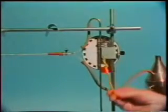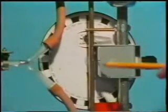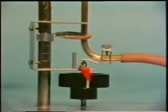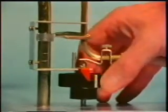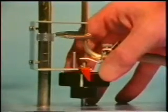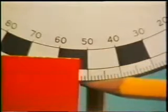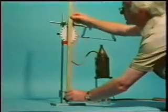Let's look at the back. Just here there's a thin metal shaft — a sort of axle. When the brass tube expands, it will rub against this shaft, causing it to rotate, and the dial attached to the shaft will rotate with it. At the bottom, supporting the brass tube, there's an accurately made micrometer screw. One complete turn of this screw pushes up the brass tube exactly one millimetre. We must note the dial reading when the brass tube has moved that one millimetre — it's 53. Now we measure the length of the brass tube, from the point where it rests on the micrometer screw to the point where it just touches the shaft of the dial. It's nearly 43.75 centimetres.